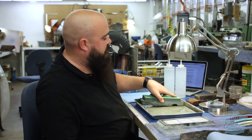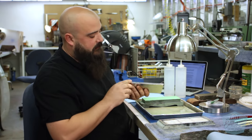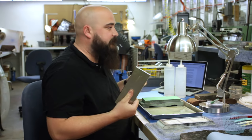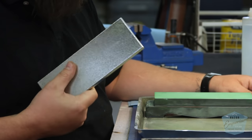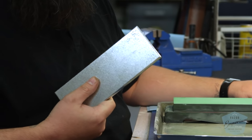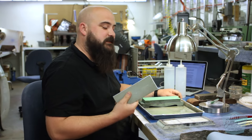The first method I use is a DMT plate — this is a 120 micron DMT plate. You can use this on most all of your synthetic stones, except once you get up to the higher grit stones. If you're using a 12k, you might want a little bit higher grit DMT plate.